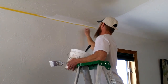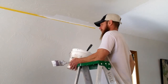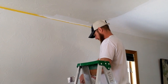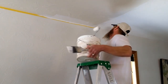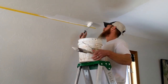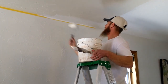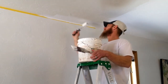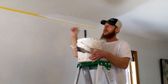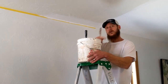If you get paint on there, take yourself a rag — that's another good thing about tape. Get as close to the corner as you can and feather it out. Do that all around your ceiling where it meets the wall where your tape is, and then I'm going to show you the next step.